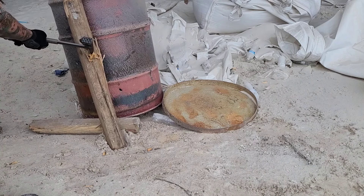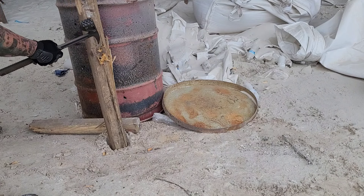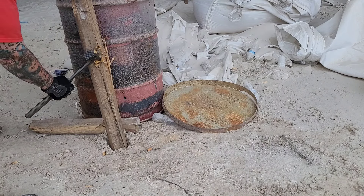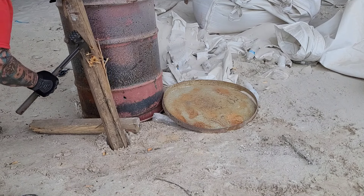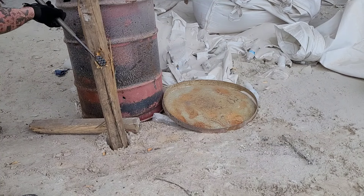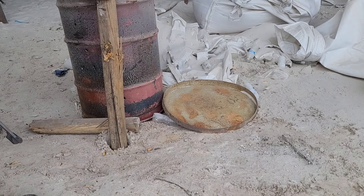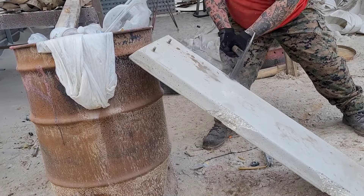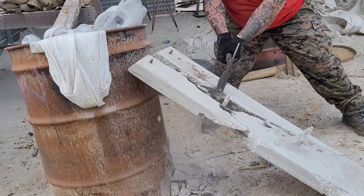This part's important. Snuggles' head is assembled with two cheeks bolted on with three hardened 4140 chromoly bolts with a tensile strength of 120,000 pounds per square inch in each. The pieces are mounted in a double shear and the bolts would be acted on together. A 50-ton press would be required to shear it. Repeated impact doesn't change the situation. Snuggles is an extremely overbuilt handheld tool.